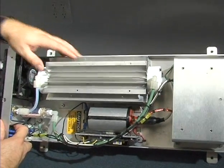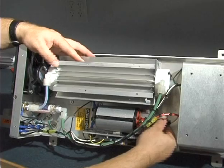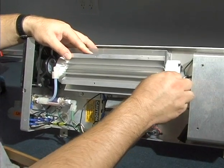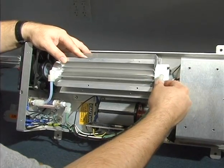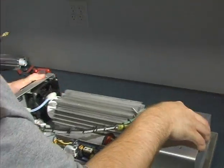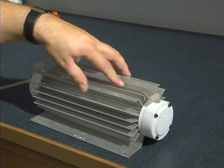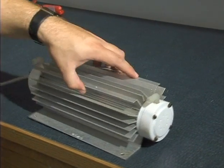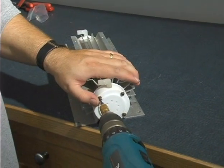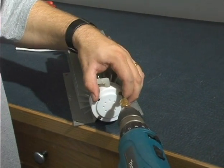To remove this, we've got the four screws — or the four nuts in the corners — and we'll remove the connection point to the coil of the transformer as well as these fittings. We don't necessarily need to mark exactly where these elbow fittings are, as they're always straight up, but remove the Allen screws on all sides.